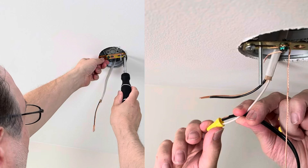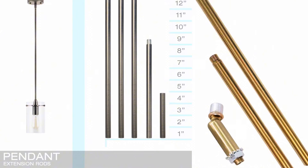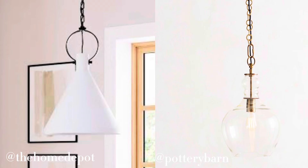If you choose your light fixtures before construction starts, you can place them in your plans and know exactly where to put them. If you haven't chosen them yet, wire for them, leave the wire up in the ceiling, have it drywalled over, and that wire will be pulled through for a junction box once you've decided on the fixtures. Another thing to consider when choosing island lighting is ceiling height and how long or short the fixture can go — some fixtures cannot be altered, some have extensions to add or remove, and some have chains which are the most flexible option.